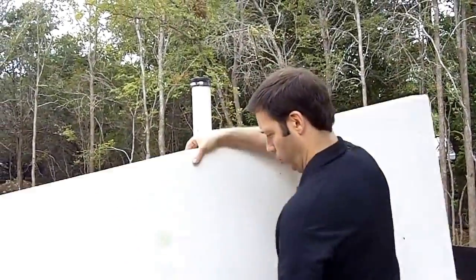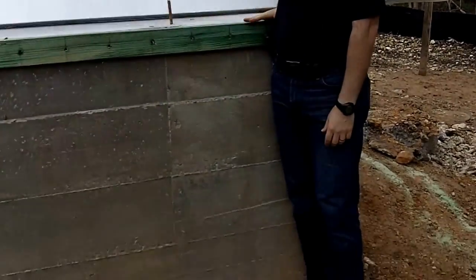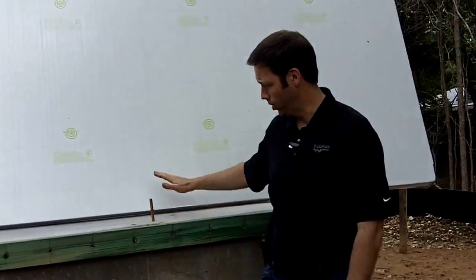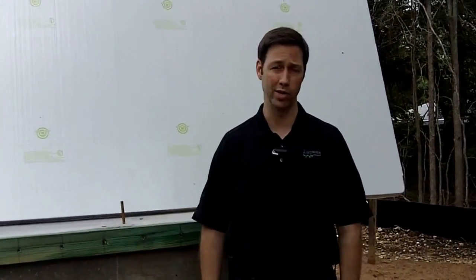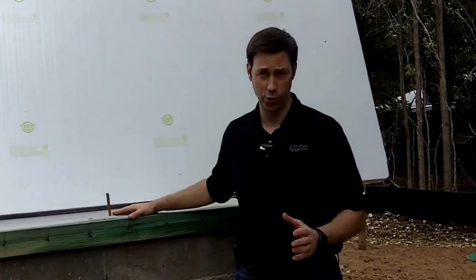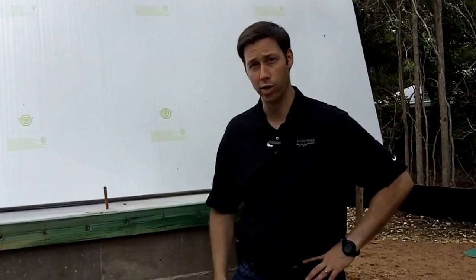Let me talk briefly about why we're doing this. As we build higher and higher performance houses, an uninsulated slab becomes more and more of a load on our houses. See how much slab we've got exposed here — we're probably four to five feet or so out of the ground, and this is totally exposed. In the summertime this is going to gain some heat; the sun is going to hit this and some of that is going to radiate into the house. Really more importantly is wintertime, when this slab is actually going to pull heat out of the house and move it through this concrete slab. Our ground temperature is going to be 50-some degrees, but the problem is this concrete is going to be in contact with ambient temperature. We're using two-by-six walls with advanced framing and exterior foam — we're going to have a very high R-value on these walls and of course we're going to do a really good job of air sealing. We always want to build tight, insulate right. And so this slab really becomes more and more of an issue the better the house we build.